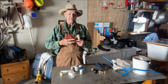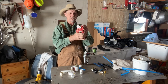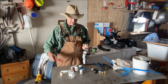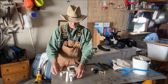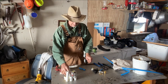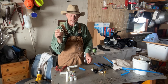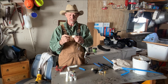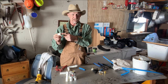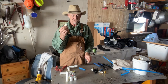What you would need for PVC pipes is some type of cutter. For years I cut them with a hacksaw, but these little cutters here are nice — you can just put it around your pipe, work it like a pair of scissors and it cuts right through. So these are nice to have on hand. That's just a simple repair for PVC piping. You'll see what fittings you need as you start to repair — they come in all different kinds: male, female, three-quarters to a half inch, three-quarters to an inch. Hundreds of them.